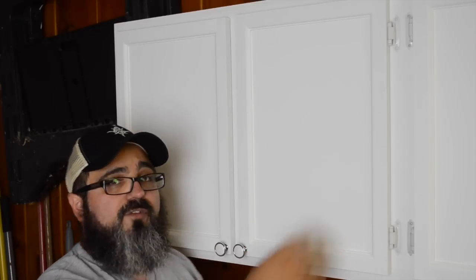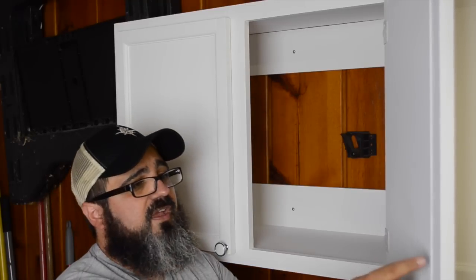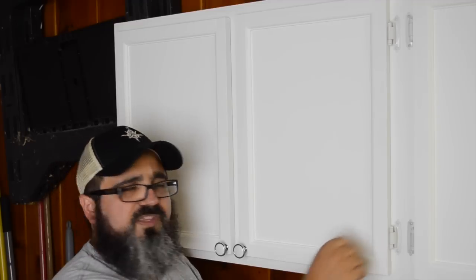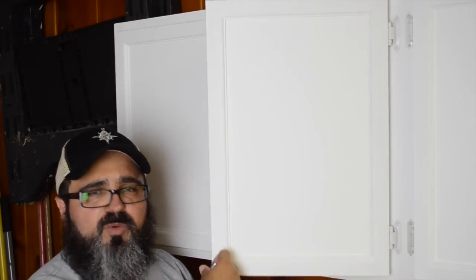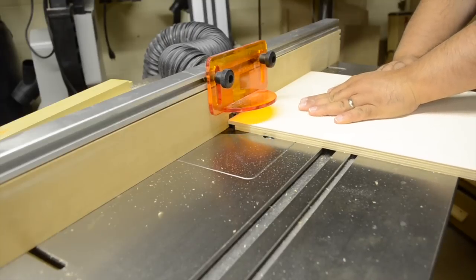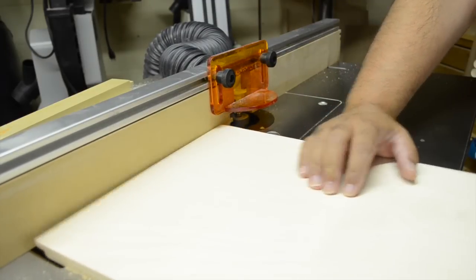For the panel itself, we're using half-inch plywood. On the backside, it sits a little bit proud of the rest — I probably could have easily used quarter-inch plywood, because that's really what the groove is sized for, but I wanted a little bit more rigidity. So I went with half-inch plywood. In order to do that, I needed to create a rabbet on all edges. I grabbed my rabbeting bit — normally I'd do this with a dado blade, but I was already at the router table, so it was really easy to set it up.